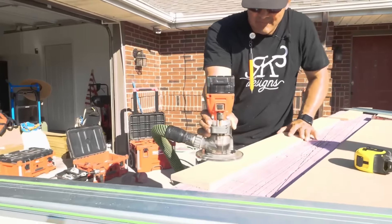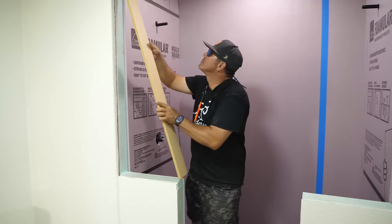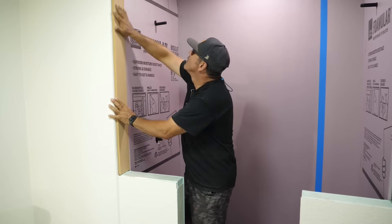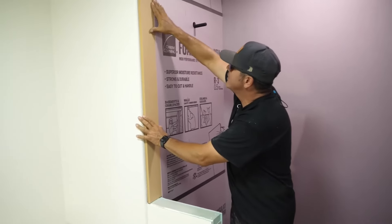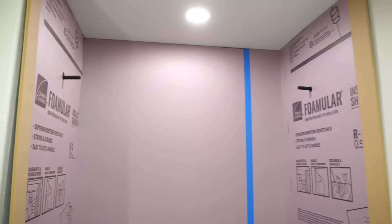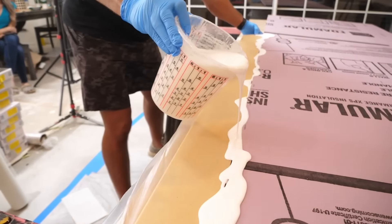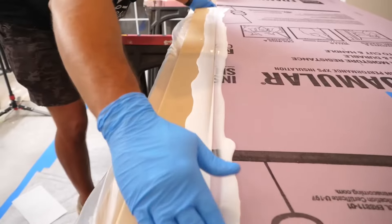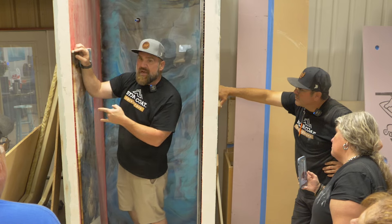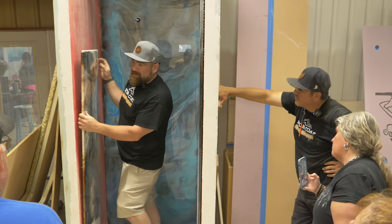I know that measurement, so I'll even put a piece of tape at the top of my shower panel. And then if I know I've got 2x4s behind my sheetrock, like here and here, wherever for those hinges, you can also put a piece of tape on your panel. I've got my 2x6 back there for you to mount to, because you cannot mount the shower door just to that piece of wood. It's going to flex because those are heavy pieces of glass, and the shower guy is going to stick screws in here hoping they hit wood.